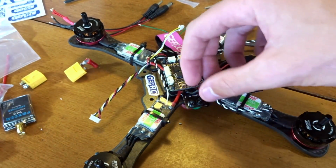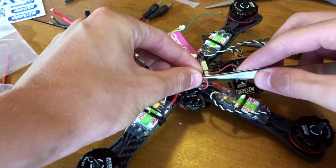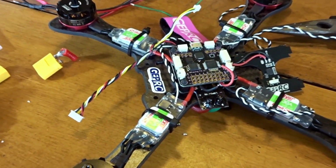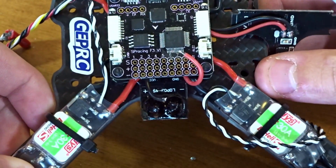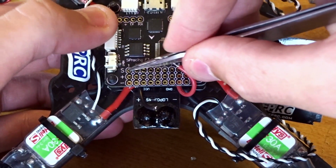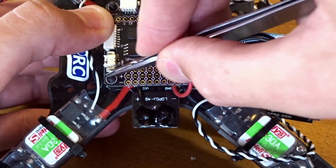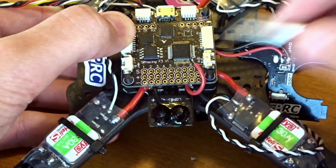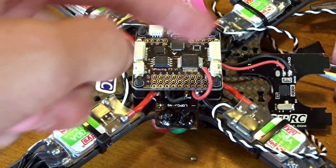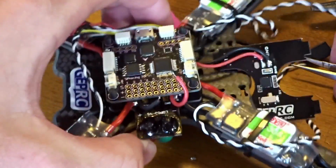So these wires, basically these red and negative, so positive negative, are just going to wrap up, and they can go anywhere on the rails here, the positive and negative rails where the signals all go. If you can see that there, the top row is signal, the middle row is positive, and the bottom row is negative. So the signals are all separate, but the positives are all connected next to each other in a rail, and the negatives are all connected in a rail. So you can put it on any of here. You're going to be using the first four, 1, 2, 3, 4 for the motors, and then I'll probably put these anywhere from 6 to 8, and then it looks like there's the boot at the end.